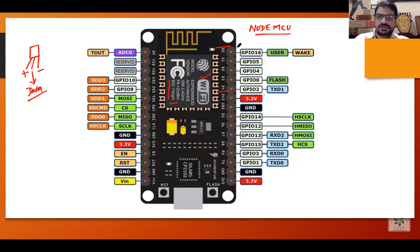Starting from this side, you can follow the number written on the board or the listed GPIO numbers. The GPIO naming is not sequential like 1, 2, 3. D0 is named GPIO 16, D1 is GPIO 5, D2 is GPIO 4, D3 is GPIO 0, and D4 is GPIO 2. There is no strict sequential ordering — it is the internal architecture that assigns these names.